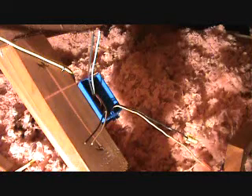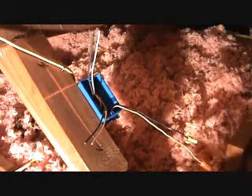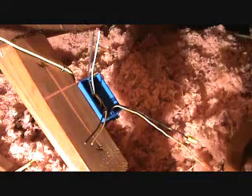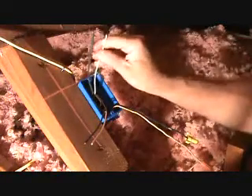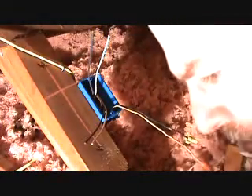That's how we're going to have to kind of do this. I usually always take the power to the light switch first, then go up to the light fixture — it's way easier for me to remember all the wires. With standard single-pole light switches you always have two black wires, and that's what we're doing here. But in this case we're going to end up making this white wire that goes to the light switch a hot wire — it's not going to be a white wire.